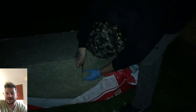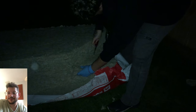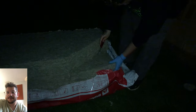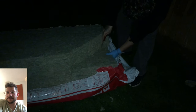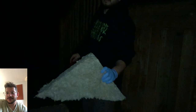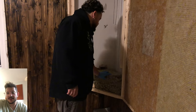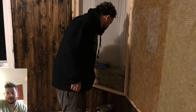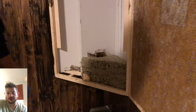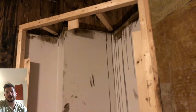Here's my friend Christian who helped out with this build — he is cutting our Rockwool Safe and Sound, which is going to fill the large triangular cavity of the bass trap. That gets cut to size with a knife; I'm using the Rockwool knife you can get at the hardware store, but a serrated bread knife would work too. We're cutting out the triangles and placing them in. The corner with the bulkhead intrusion gets two separate triangles, while the other side uses large single triangles to fill the cavity.